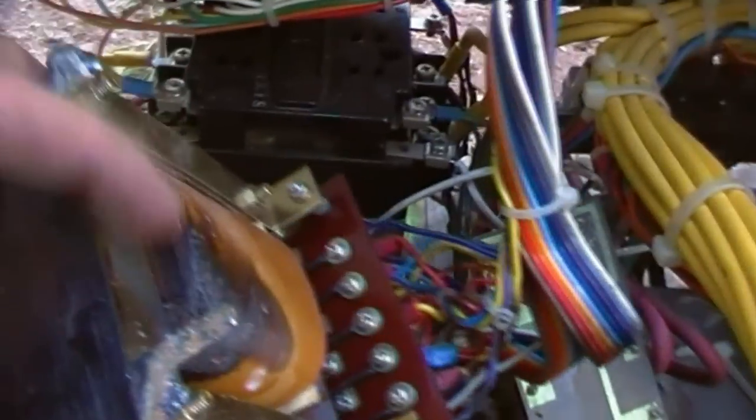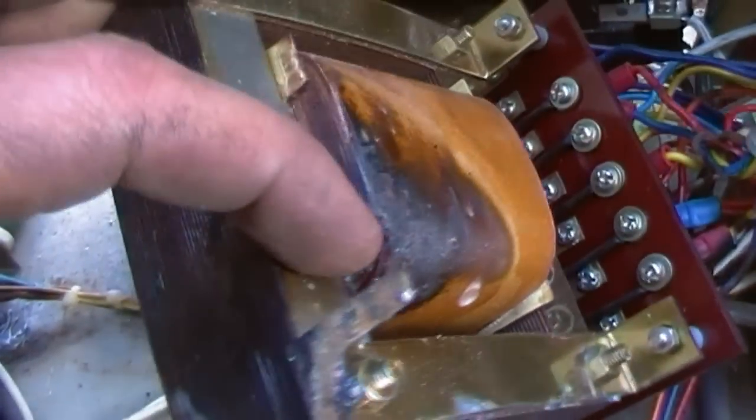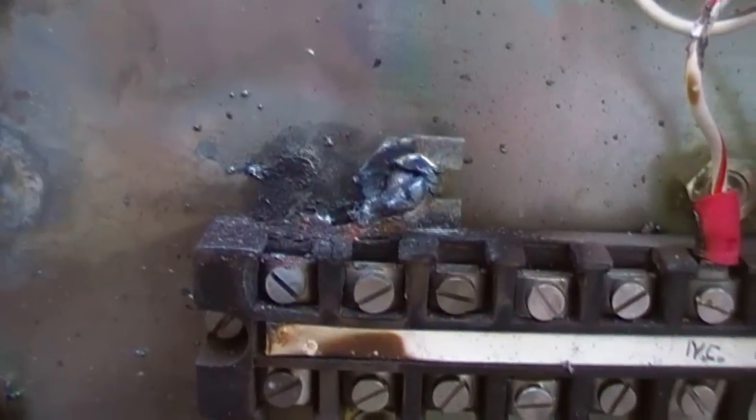The main transformer is out - I've cut it out. There's the wiring off it, I'll just cut the wires and undo them. Might keep that transformer, depends on what voltage it'll put in and get out of it. This is the problem transformer - I think this is one of the main faults that's happened here. The wires have burnt out and gone to ground by the looks of it. That's why it's blown off the earth stems, done that damage to the bus bar there and cooked this transformer below it.